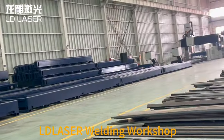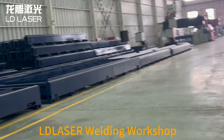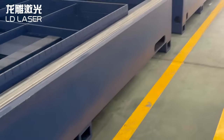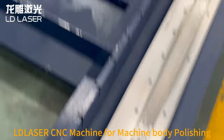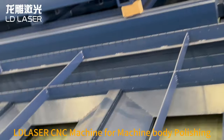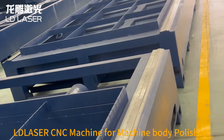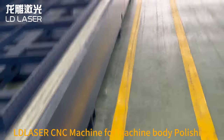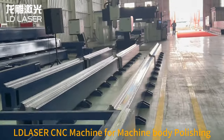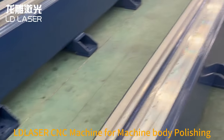And over there are our CNC milling machines. It's still working. Each machine body, we will mill with the CNC machines, to make sure all the screw holes and the transmission are in a very straight direction, and also the axis error is just 0.03 millimeters. For this CNC milling, the first time we will use metal tools, metal blades, to mill the painting, to remove the painting and other things.